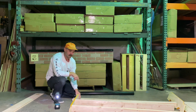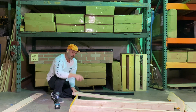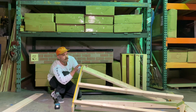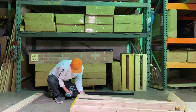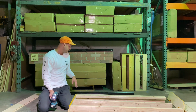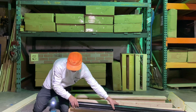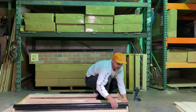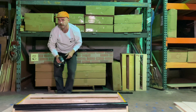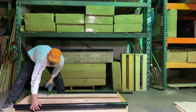This one here underneath the square coping is going to be horizontal instead of vertical like the others. You want to get it flush with the lower part here. So I've got this whole side attached — all my two-by-fours — and I'm going to go ahead and attach it to the coping at this time as well. Now this is all lined up, coping in place, so I can go ahead and sink this screw into the two-by-two that is attached to the bottom of the coping.